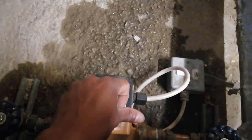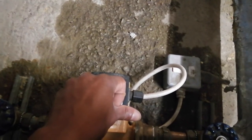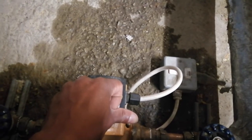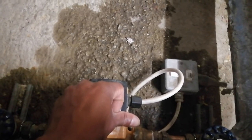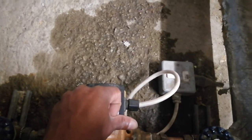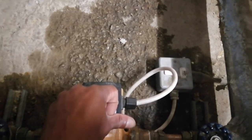Although this pump is rotating, I may check the amps on it. I heard it's not that old, but I will see how much current it's drawing, as it's quite an integral part of this system and the hot water supply. Until next time, bye!